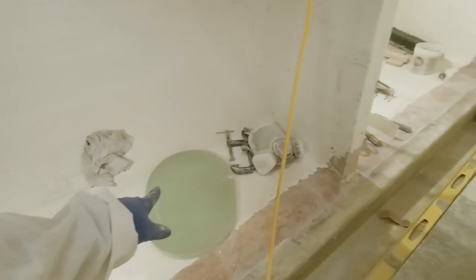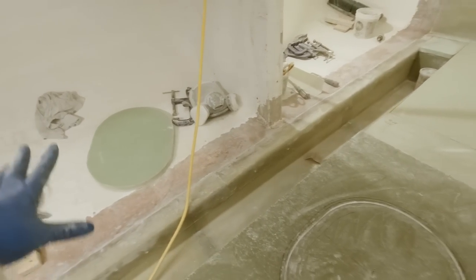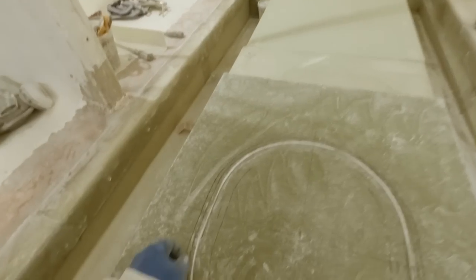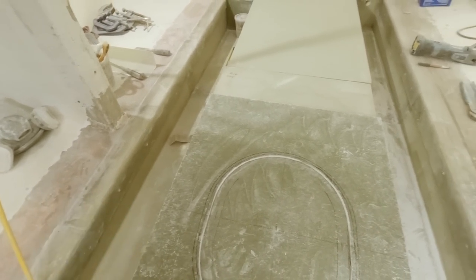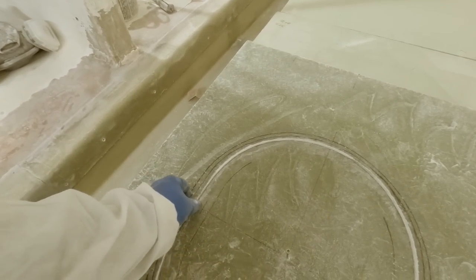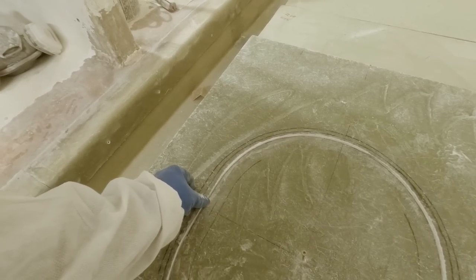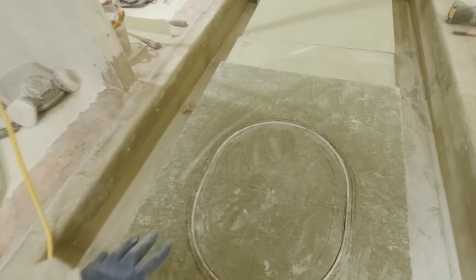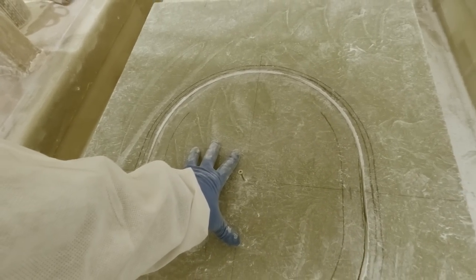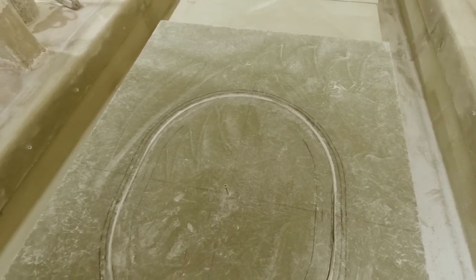I had one of the original plugs that I used to cut out of the layer underneath, but it's actually smaller now because I have to give it room for the fiberglass, as the edges are coated. It reduces the size by about half an inch altogether. It's just shy of a quarter inch on each layer, so this inside hatch has to be a little bit smaller. So this hatch here is cut to size, and I'll come in here and cut this back a little bit to make up the difference between the two.